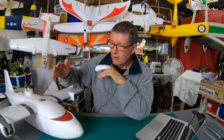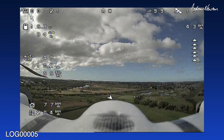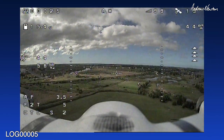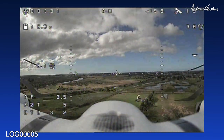The first flight I took it out untrimmed and untuned, just with my stock settings on INAV 2.6 on the F405 wing board. I can show you some of the footage of the oscillations I was getting — quite marked and possibly even dangerous in a return to home. It may induce a stall on some sorts of planes. I sent the black box log to Mark and he could see it was obviously out of trim for the elevator because the I-term was maxed out trying to push the nose down all the time.